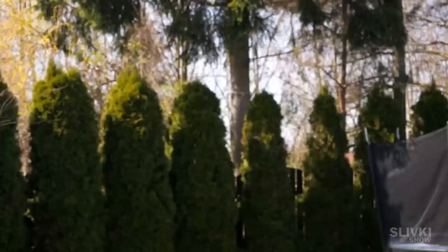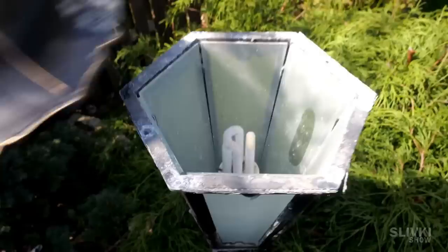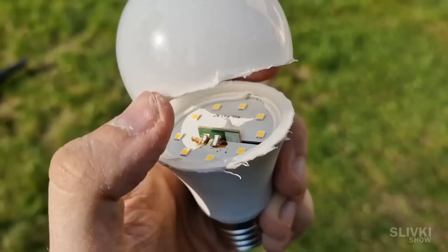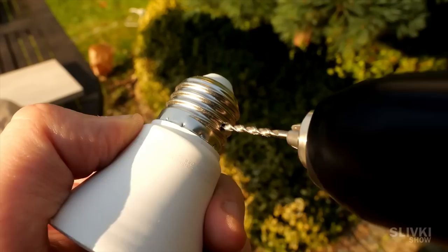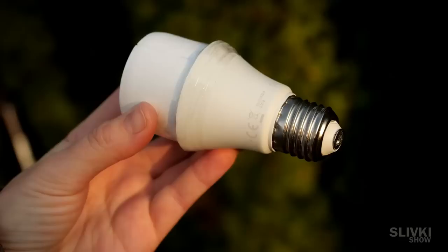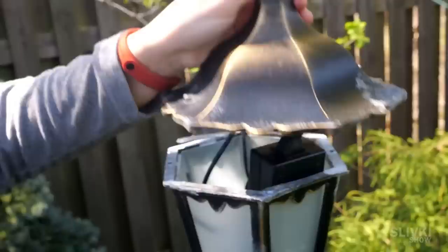But I got a little problem — there's no socket on the tree. The closest source of electricity is in a nearby lantern, which doesn't have a socket but has a bulb and a socket for it. To connect power I take a non-working bulb, cut off the plastic cover to get to the inside, take out the board with a screwdriver, make small holes in the plus and minus contacts, put the wires inside and solder them. On the other side I put a standard socket from the construction store, fasten everything with tape and get a gadget that can be screwed into the lamp. I insert the power supply and cover it all with a lid to protect it from the rain.